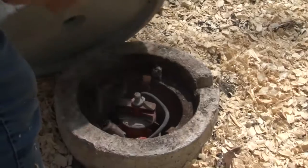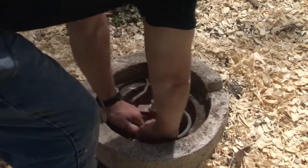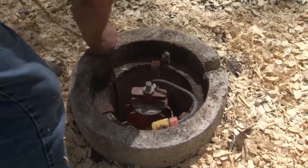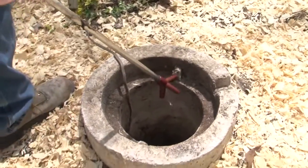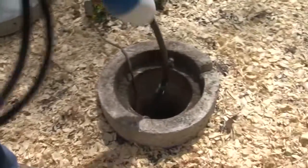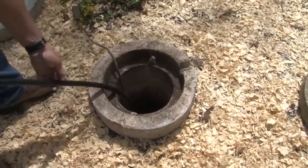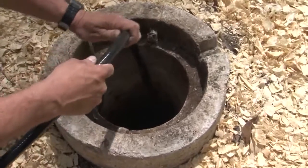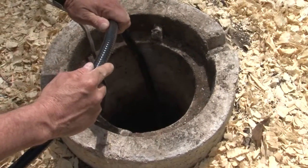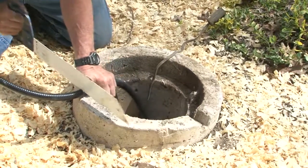So I got it cut off. I'm going to set this to the side and unplug this aerator. I know the power's off because I have it cut off in the building — that's a timer. I'm going to stick my diffuser in there. It's a weighted diffuser that hangs from a float. And I'm going to cut this thing off where there's a little bit of extra cord so I can make my connection to my pump. I'll just take my saw and cut it to the length I want.